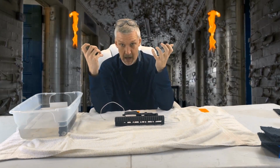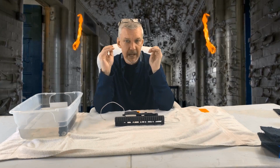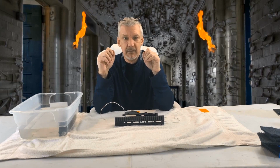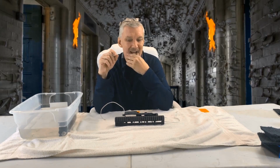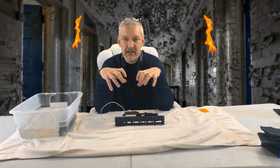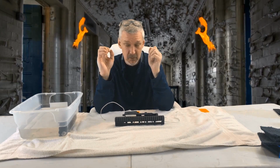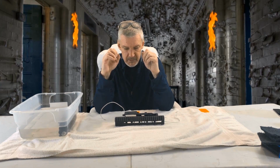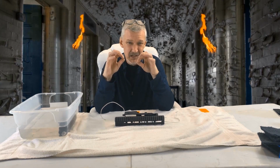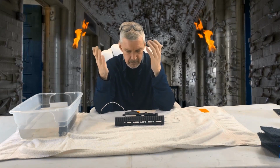Then when you Cerakote, we're going to let the Cerakote dry completely. Then we're going to put it in the oven at 180 degrees for a minimum of 3 hours. Leave the stencils on once you put them in the oven. Once they come out of the oven and they're dry, before you even think about trying to put any of this together, give it a minimum of 24 hours. I typically give it about 2 days, but you want to let it cure for a minimum of 24 hours. Once you pull these out of the oven and the curing process is basically done, you can peel the stencils off then, but go ahead and leave them on even during the curing process.